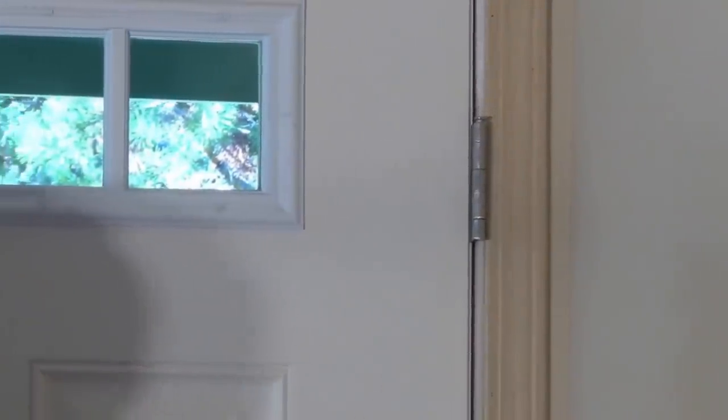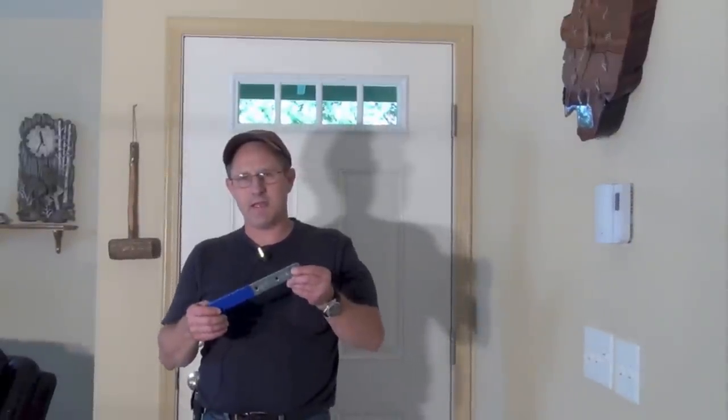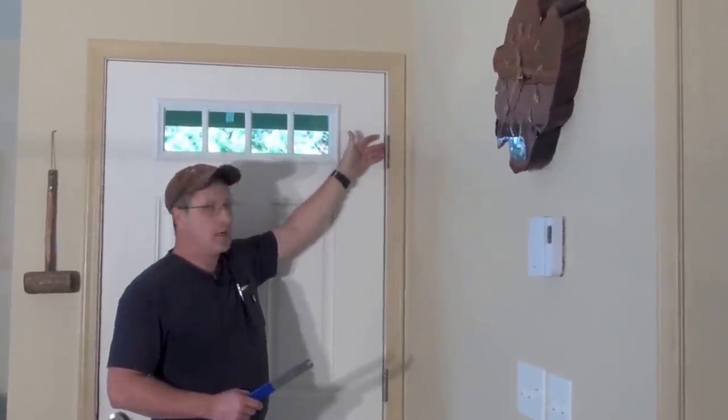Went in slick. Let's come over to the door — you can see the gap, the door even shuts better. Notice the gap all the way down is nice and even — a lot better. Make yourself a handy dandy hinge fixer. Remember, a lot of times you just put the first hinge pin in, line it up, drop it down, and that'll help you line up the second one. Hope that helped — give me a thumbs up if you liked the video. Comments always help, and subscribing and sharing our videos helps even more. Thanks, we'll see you next time.